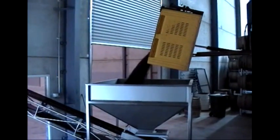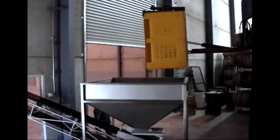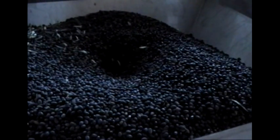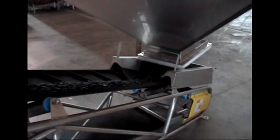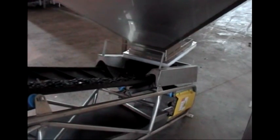We've got 500 kilos, just getting the last of those olives out of the bin. The operator is cleaning up and it's sitting in the bin. You can see how they're starting to go down into that slide valve at the bottom of the hopper. You can see the olives flowing out on the conveyor belt — it's running now at about 3 tonnes an hour.